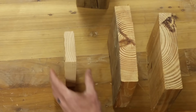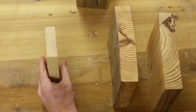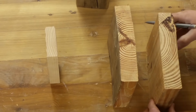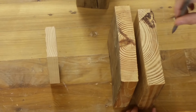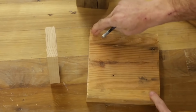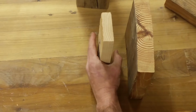Ideally what you want is something that is almost straight-grained. This is still a flat-sawn board but it's farther out on the tree and you're going to get a lot better material out of that. When getting 2x6s, avoid the large 2x12 pieces because they will still warp over time - they will always have a rock to them. The best thing you can do is buy thinner boards, 2x6s at most, and try to get straight-grained.